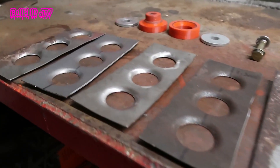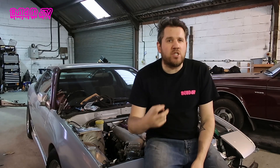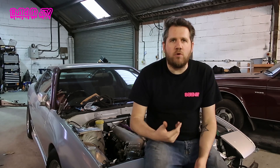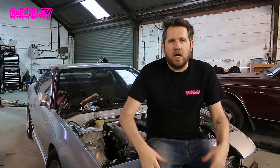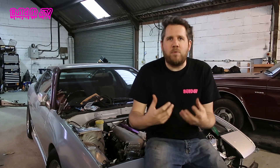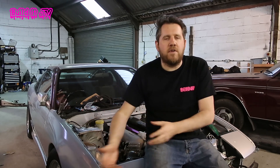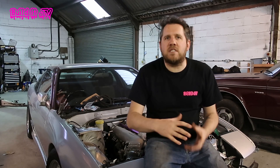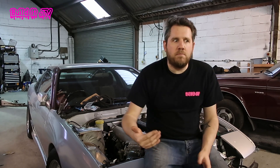Personally I think it's worked really well. If you're going to do 1.2mm, you could probably do it all day. We got some pretty good presses out of that die, and if we hadn't taken it up to the 2mm, we could reuse it over and over. On 1.2mm or even 1.5mm, I think you could run it for a good long time. I love the fact that it comes from 3D printing — first people used it to build stuff, now they're using it to build tools to build other stuff, like moulds. That's a really good concept for any project.